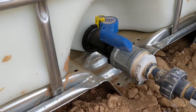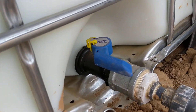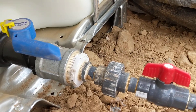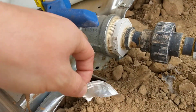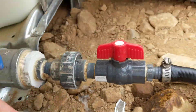The neat chemical comes out of the bottom of the tote here. It's a 2-inch NPT fitting with a ball valve. You can see we've got a union here and another ball valve, and that allows for a real clean swap out when you swap it out. There's gonna be a foil at the end of this that you need to get rid of. We did a nice job here.